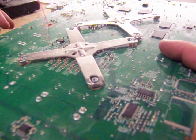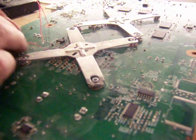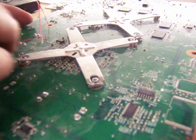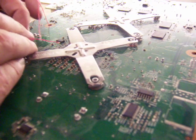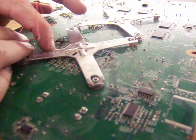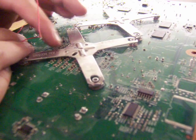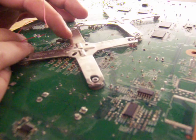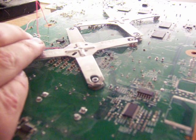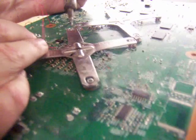I'm going to hook up CPU PLL bypass first so that I'm running the post out one wire over it rather than under it. What you're looking for is above the x-clamp — the spot called TP763. Right next to it, to the right, there are two spots with solder; you want to solder to the one on the right, the second one. The easiest way is to tin your wire first, because that spot is so tiny it's hard to get solder to stick.